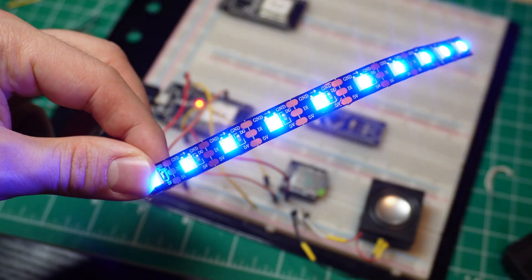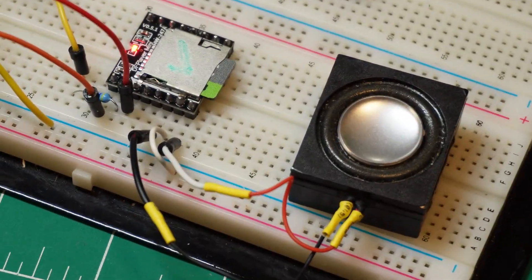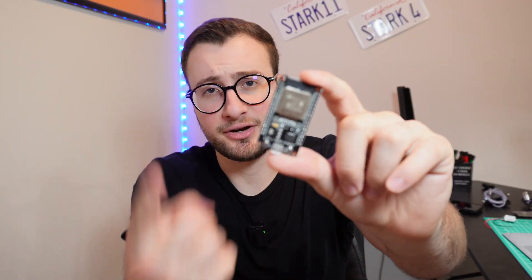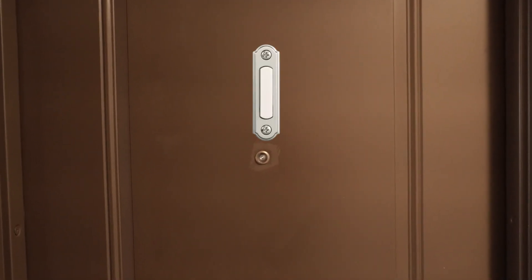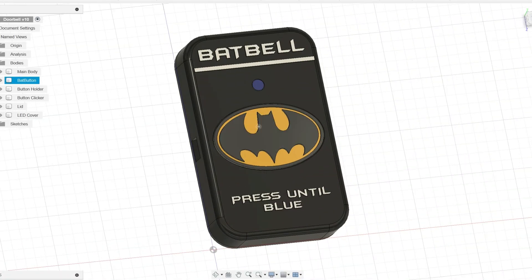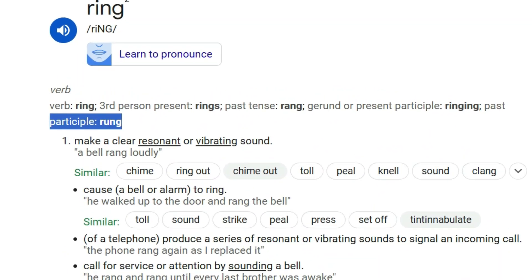This microcontroller is also capable of controlling LED strip lights and MP3 players, which are two essential things needed to create a signal: visual alert and sound. So we'll definitely use an ESP32 to bring this project to life. Next, we'll have to design the front door button. We want something simple, not too big, and that will perfectly hold the circuit. So I came up with a design that has the bat logo as the button, and an indicator LED to let the person know that the bell has been rung — and yes, that's the past participle of the word ring.